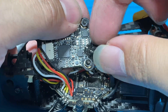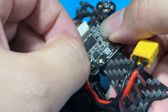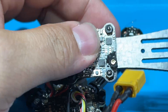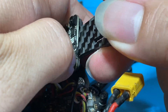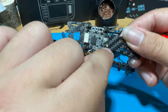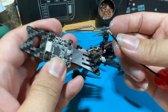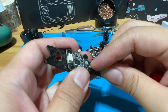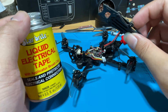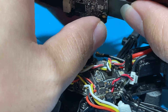Next, we are going to remove the gel off the VTX — otherwise we cannot remove it, so you just have to use some force. Next step: we will be connecting the antennas to the VTX. As you can see, this UFL port is really just an easy snap-in, but it can also easily be pulled out, so we need something to hold it there. Let's start by snapping the antennas in.